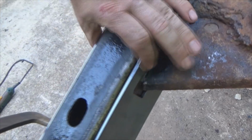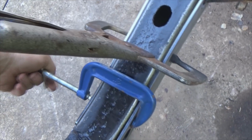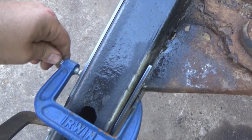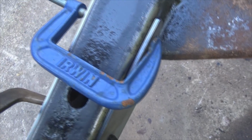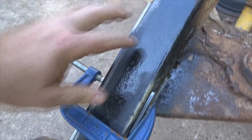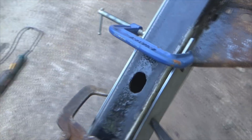Just keep your clamps moving, squeezing metal down, like this right here. See where it's bowed out? Move my clamp. I put it just before, and bump it up on it a little bit so you get right close to the edge. And see, got that squeezed down, so I can run me a tack here, a tack on the end right here, which will hold that in place, and which also got everything flushed down through here. So run your little short tacks through here, get underneath here and check, and do the same thing.